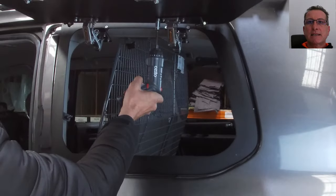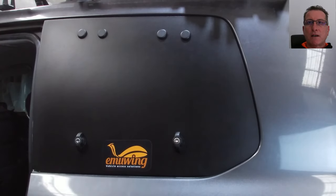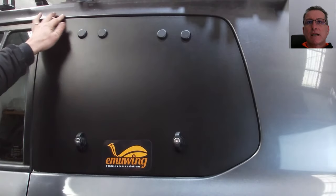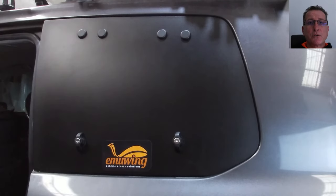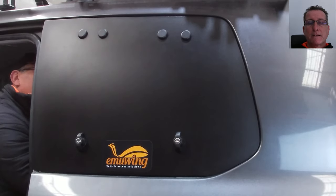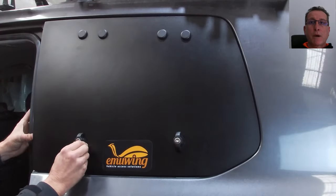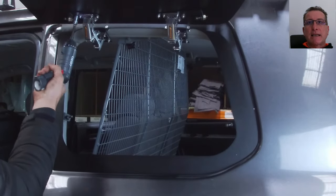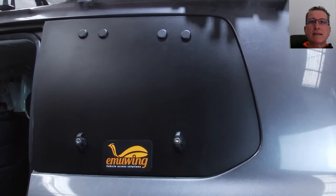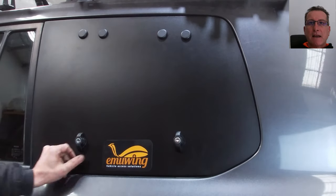Also try to get a straight line along those pan heads. Just got to adjust it a little tiny bit. Now we've got a straight line across the four pan heads. I notice that the door's sitting proud at the front edge there, so I do need to adjust the depth of that door. We can do that just by undoing the two opposing M4 bolts. Once they're loose we can simply push the door panel back to the depth we require. However, by doing that it's actually lowered the door slightly, so now I need to loosen off my pan heads, reinsert my spacer, and double check my gaps — especially that door.